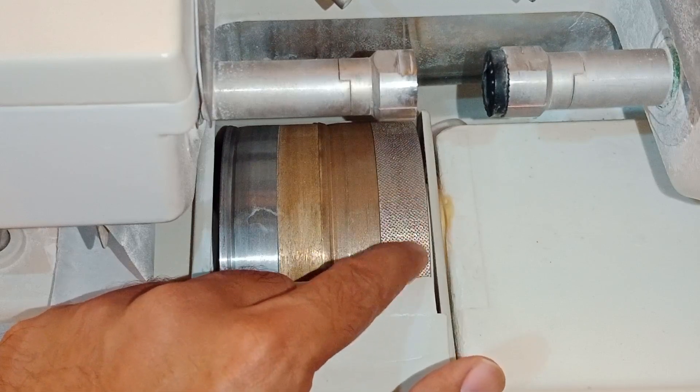The lens is now ready and the machine has automatically returned to its rest position. To remove the lens, grip it and press the chuck button — the lens is released. As you can see, the axis line and metal line are still aligned, so there is no change in axis. The pattern and the real blank are now the same size and the same shape.